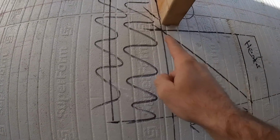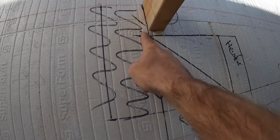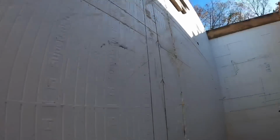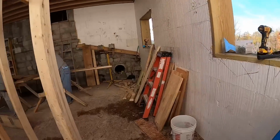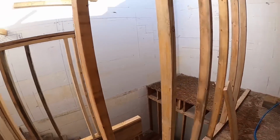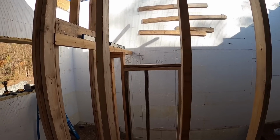So this is the angle that makes sure we have our 84 inches of headspace, and we're going to accomplish that. So as we walk down, everything ends up above your head, which created all this interesting framework, and that's okay. The biggest thing that I wanted to make sure that we had was support on the ends and support in the middle. We'll have all of that with the way we're going to install it.